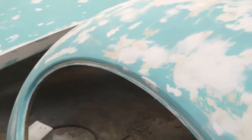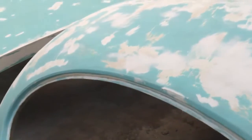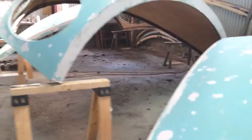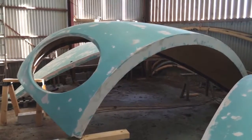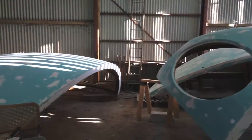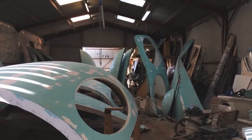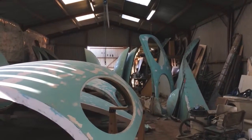Today got a little bit more work to do in rebuilding up the window frames, which, I guess because they had the rubber seals of the perspex windows in, perished quite a lot from damp, so there's been a lot of gouging out of those and making good. So we're going to put a hardener on the existing fiberglass first, roll that on, and then we are going to spray the primer, which is very exciting.